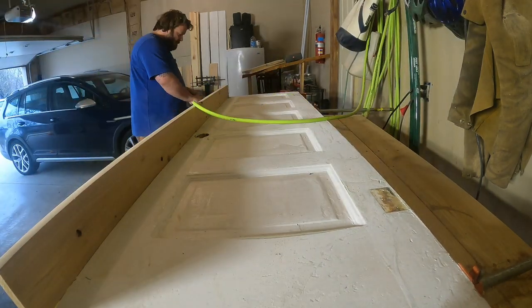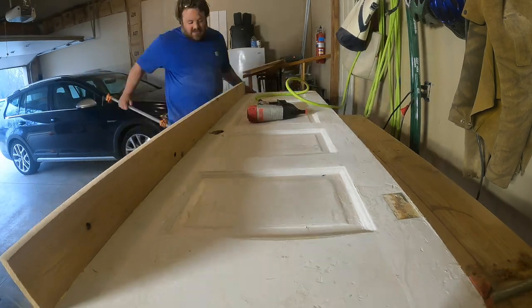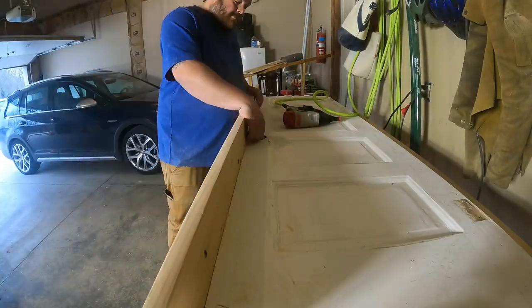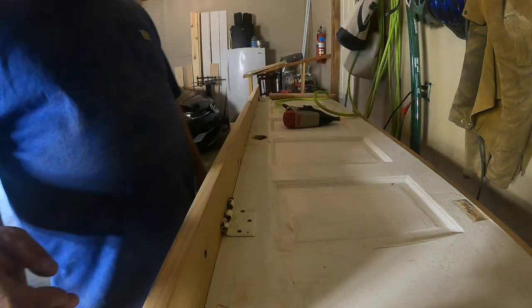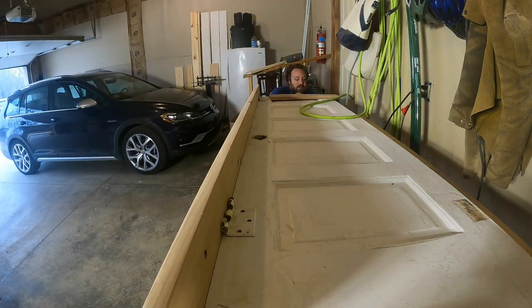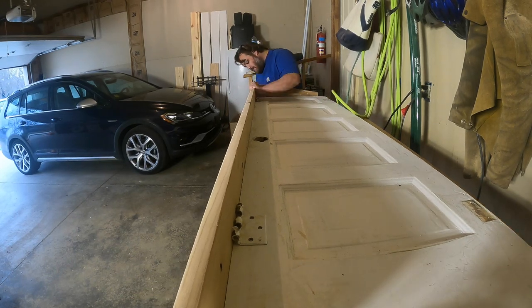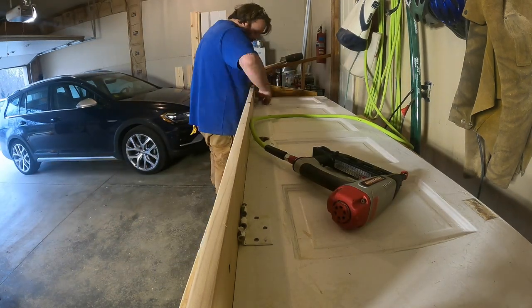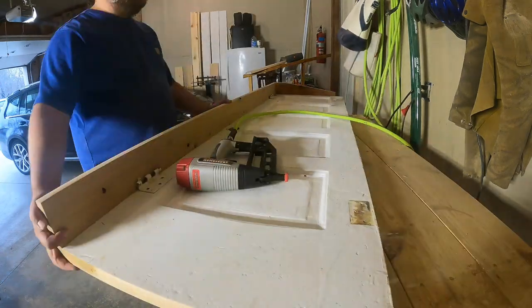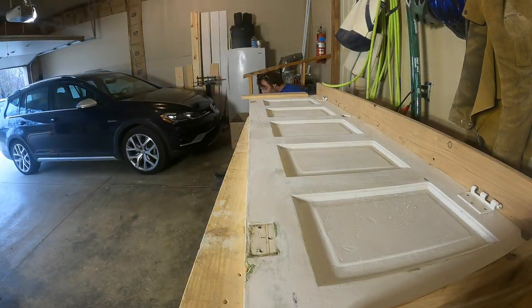About a 30 or 40 degree angle — it doesn't really matter. You cut an angle on a board, you make two strips out of it so they fit together. Then you can mount one to the wall, hit studs, make it perfectly level. Then you mount the other one to the thing you want to mount to the wall, and they'll slide right onto each other. First, I'm attaching these sides that I made — same way I attached the top, just some glue and a few brad nails. This is an 18 gauge finish nailer. Then I get that second side on there.